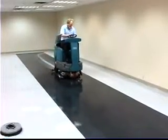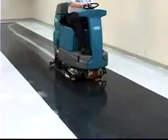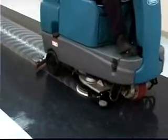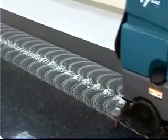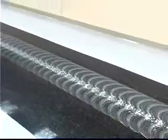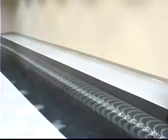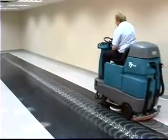Note: do not use the FAST system with conventional cleaning detergents in the solution tank. Drain, rinse, and refill the solution tank with clear, cool water before operating the FAST system. While using FAST, having any conventional cleaning detergents in the solution tank may cause unsatisfactory floor cleaning results or malfunction of the FAST system.